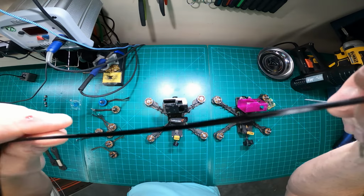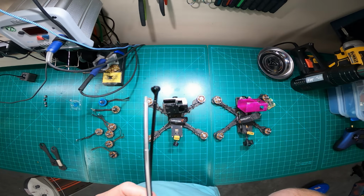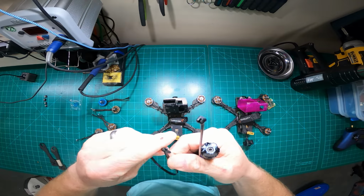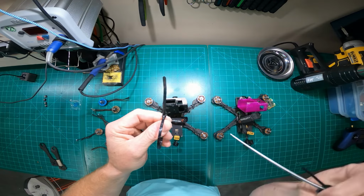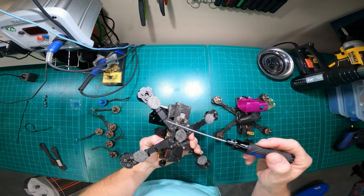And again, you guys may be like, why in the world are you paying $8 for zip ties? Well, a couple of reasons. One is there's a metal shank in here. You probably can't see it, but there is a metal shank in there. So you get extreme locking when you zip these things down. You're never gonna pull that through because of that steel shank right there. And two, with 50 pounds and even 18 pounds, I rarely ever replace zip ties, ever.